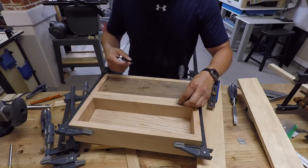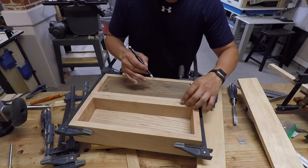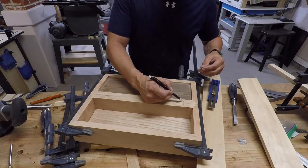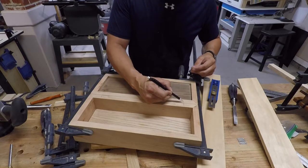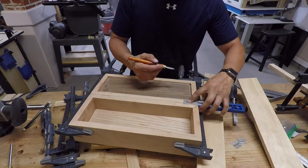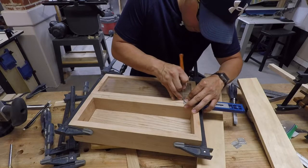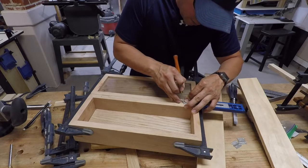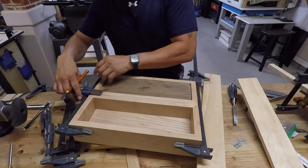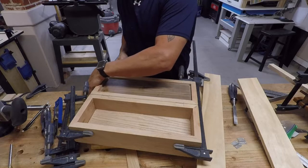I can go ahead and strike the line here, but prior to doing that I want to get the hinge again. Now again this is not going to be 100% accurate as the marking gauge showed you, but I do want an idea of where this hinge is going to stop. I'll do the same on this side so that's already in place. I know that my knife - even though the marking gauge is going to be about a sixteenth of an inch higher than this line - is not going to pass my mark. I don't want to pass that line, so I'm going to go ahead and strike this line. Same exact process as we did with the mortises on the box. This clamp is in my way so I'm going to have to readjust it, but since this clamp is holding it in position all I've got to do is just flatten it out once I drop it.